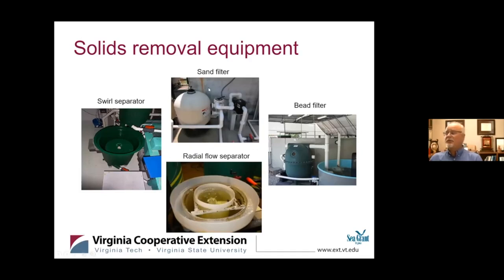That's just a regular pool filter. And they work well for low loaded systems, lower temperature systems. The problem with sand filters is they'll tend to cake. And when you backwash, they don't backwash properly from the organics. But people do use these.